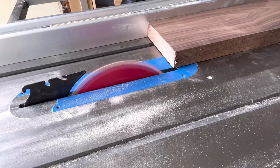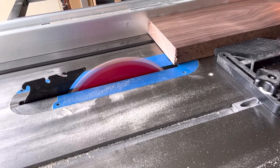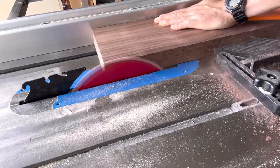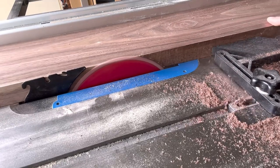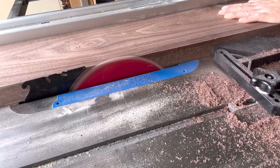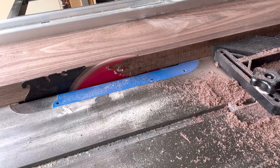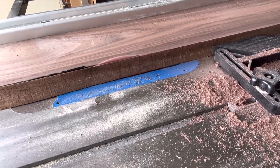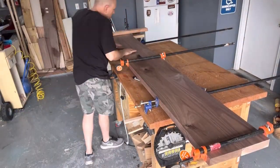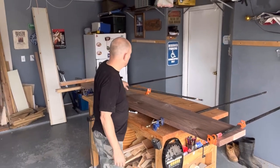Since I don't have a jointer, I had to get the edges jointed as well. Once the tops and bottoms were nice and flat, I ran them through my table saw. I was only able to do this because these boards already had one edge that was milled nice and flat, so I didn't need any jig. To get ready for the glue-up I did a mock fit-up — I just wanted to make sure the joint was nice and tight with no gaps. It turned out really well, all done on the table saw with no jig.